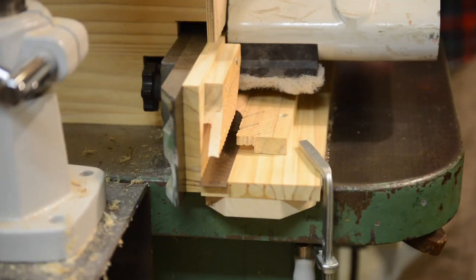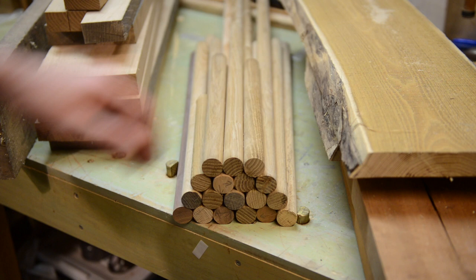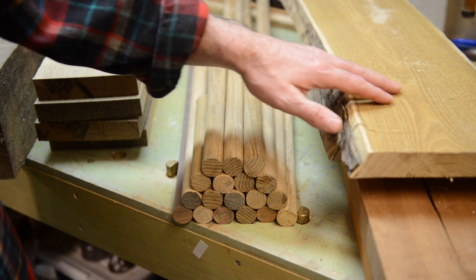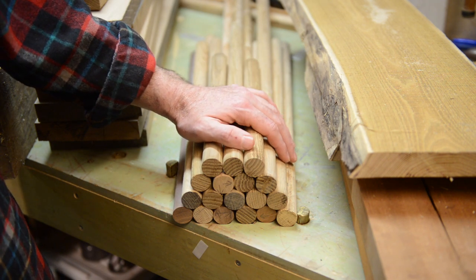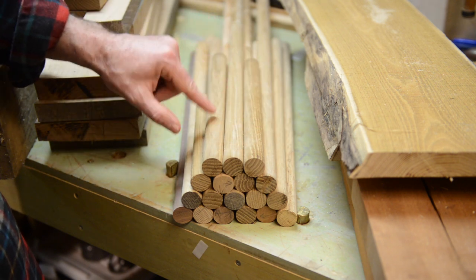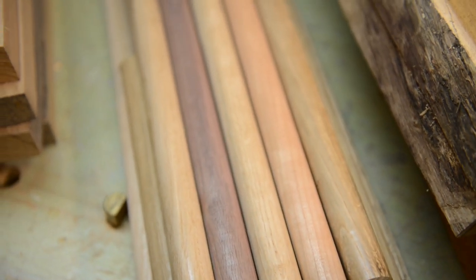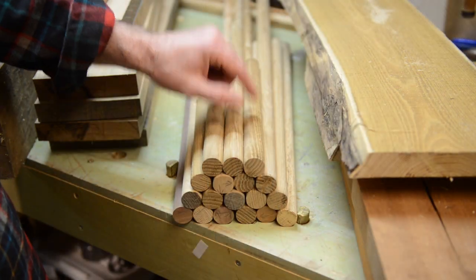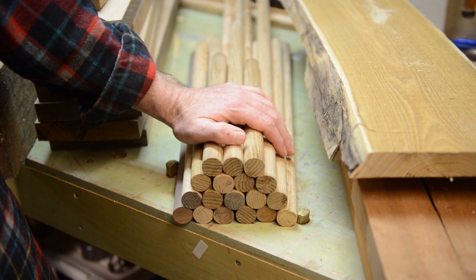With a heavily jigged-up, well-guarded machine and a power feeder, there really isn't a lot to see with the milling process. This first extended test run has worked out really well — I'm happy with the results. There's probably enough material here for 40 pegs, and I expect enough raw material ready for another 100 more. With another three runs I'll probably have enough pegs for the whole shop. The Whitehill cutter block is providing an almost glass-smooth finish. Your pegs should be tight in the pre-drilled holes, but there's no reason for more friction than absolutely necessary when driving them in, so this finish will be much nicer than the rough commercial pegs I've unfortunately had to use lately.